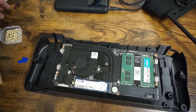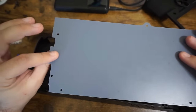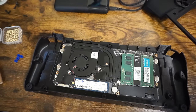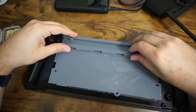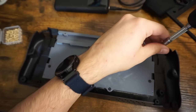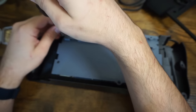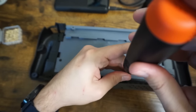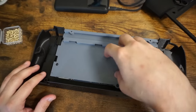Here's one of the goofier parts. These are 10mm M3 screws. In the idea of trying to make everything as printable as possible, I wanted to print this as one flat piece - I didn't want little nubs sticking off the back. So I 3D printed separate little standoffs that go on each screw. Some of the keen-eyed among you might recognize this as a Linus Tech Tips screwdriver. Something fun to mention is Linus himself owns a part of Framework Laptops - he's an investor with them. In true Linus fashion, when I first mocked everything up, I did play Crab Rave over the speakers. Everything's cinched down - the motherboard is installed, there's room for the fan to breathe, and the battery will go in here later.